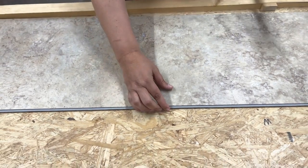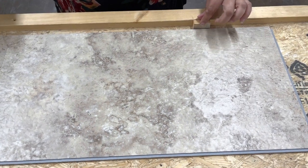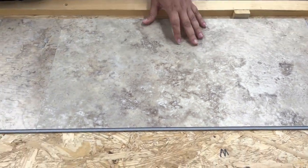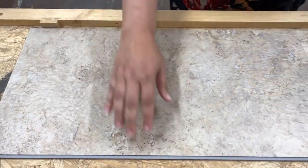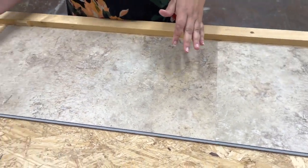So let's just say this is our first row. You always have to have your quarter inch — or even a little bit bigger — expansion gap, and that's what these spacer blocks are about. Now I'm leaning against two of them so I've got a nice stable position to start working the next row.